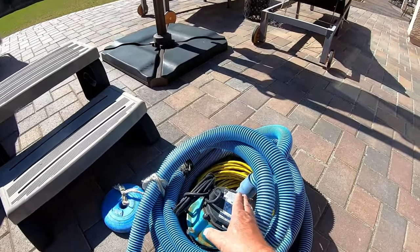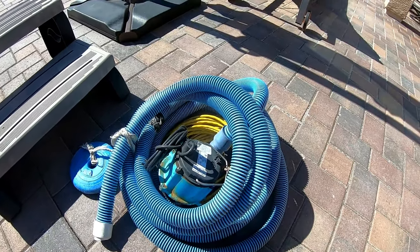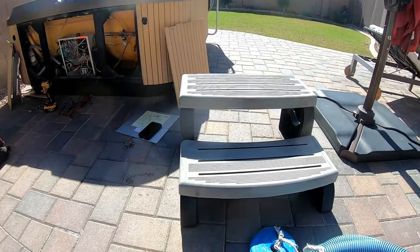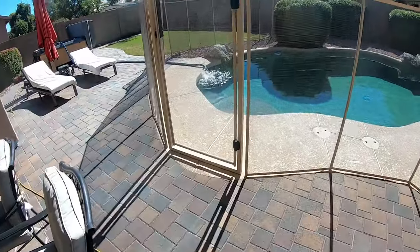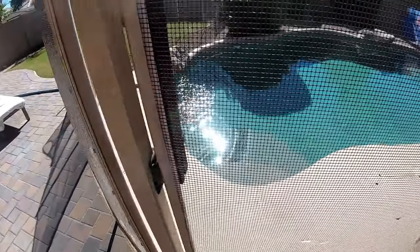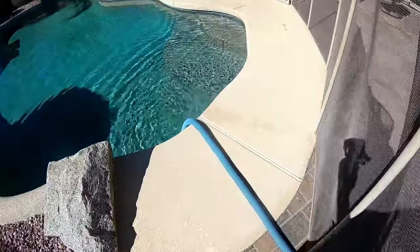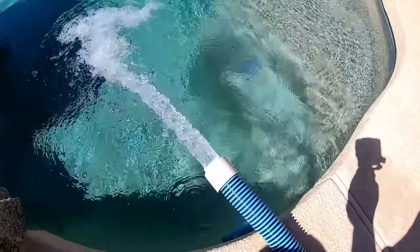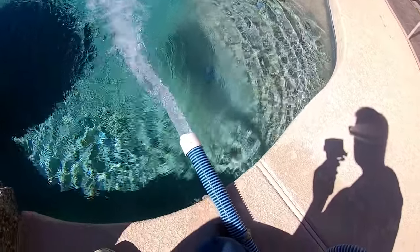This is the way I'm going to be doing it today. I always recommend getting one of these pumps because I hate pumping out the hot tub through the drain at the bottom — they seem to do it really slow and they leak. If you look over at the pool, that thing is self-priming and will immediately start pumping water. This pump will pump out 78 gallons a minute — it is worth its weight in gold.